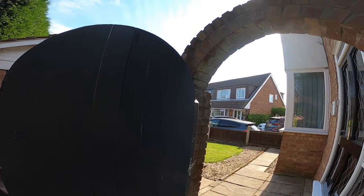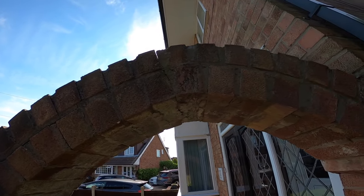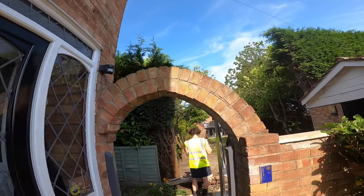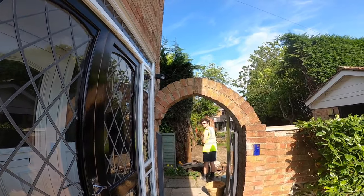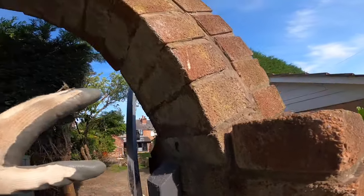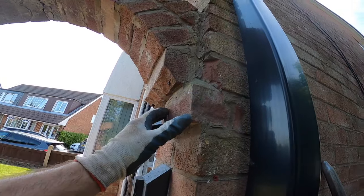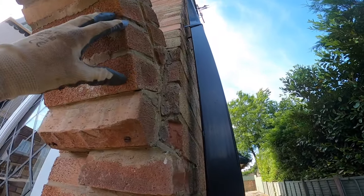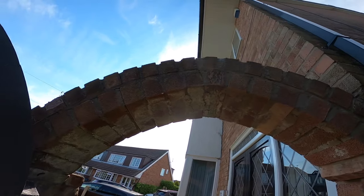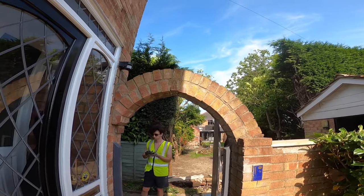Okay. Oh yes, this is the other job. This beautiful arch. What kind of arch would you say that's called? Semicircular, segmental. I'd say that one's called a wonky arch. So it springs off this wall, which is fine, but get to the other side, it springs off this brick, which has got a tiny little oversail underneath it and two screws. The whole arch springs off that. So it's just a disaster. We're not even going to try and fix that. That's just coming down, get rid of it. A nice arch is a nice feature, but that's not a nice arch. So we're going to get that boshed off as well.